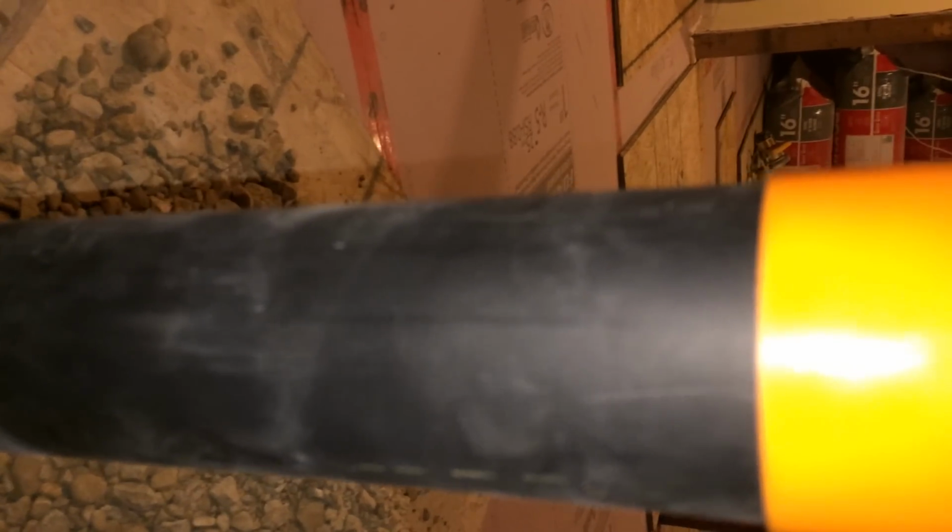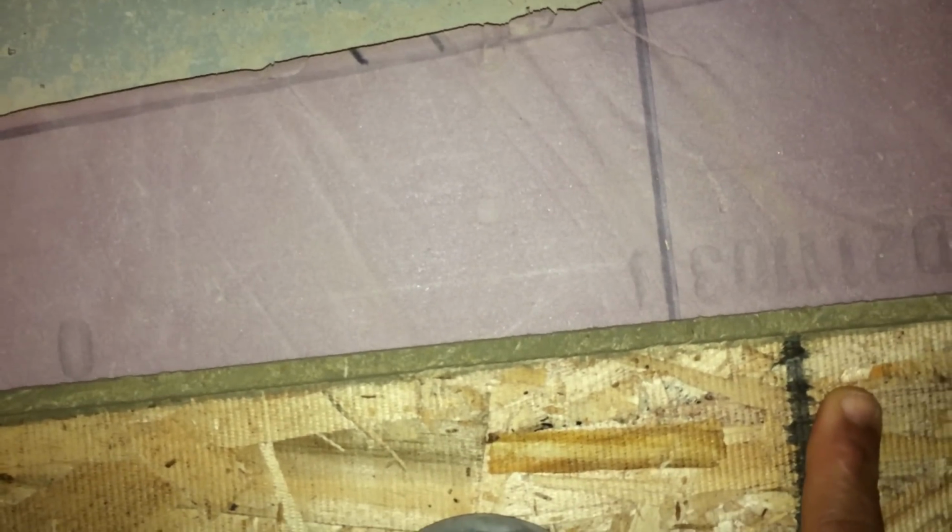That's actually an extra long turn, 90-degree elbow, 2-inch, and this extends 22 inches above the floor. I will make all the final adjustments after. I just wanted to get it at 22 because I've got 1 inch of foam on the ground, and I got a 5/8 subfloor that I'm putting down.